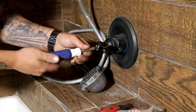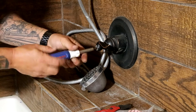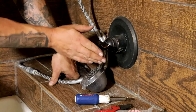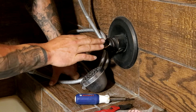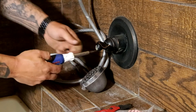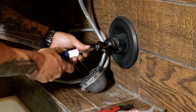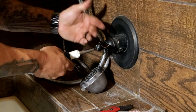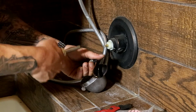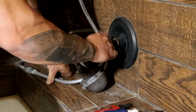Take the handle off. This shower actually has a diverter valve on it. If it has a temperature control separate from the handle, that's going to be an 1800 series valve — a very different, more expensive cartridge. But it's similar: you remove the clip off the front, take the handle off, and after that it's very similar.